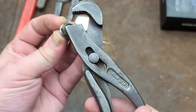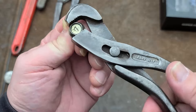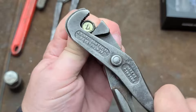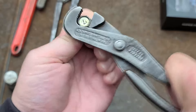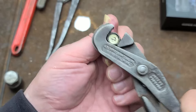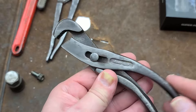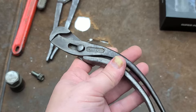There's a big advantage to these even in tight spots — and they actually have a kind of ratcheting function. They're a little funky to use sometimes, but you can turn a bolt and all you have to do is maintain a light amount of tension. When loosening you go the other way. That's another huge advantage: they're actually really easy to use in a ratcheting fashion, so you can use an open-end wrench to break a bolt loose in a tight area, then get in there with these and work it out in a reasonable amount of time. For how simple this design is, it's actually pretty effective, and it's a shame they're so obscure and nobody else is making them.